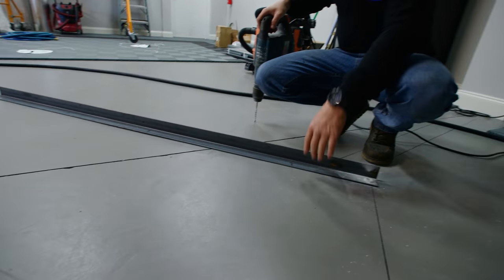Okay. So we eyeball about center, which is about right there. Then what I do is spin these couplers off. And this is a sacrificial bolt, because if you hit the top of this a lot, you'll round it over and then you'll never get a coupling nut on there. So I thread this one on here, and this being my sacrificial bolt, thread that in there. Out. The eye bolt goes in.